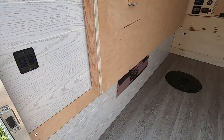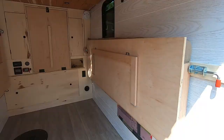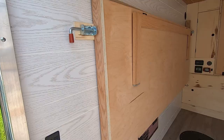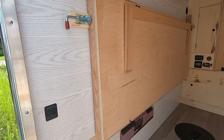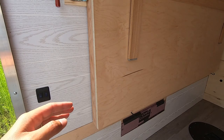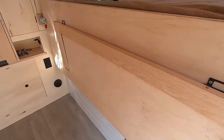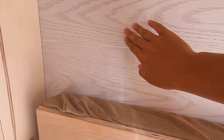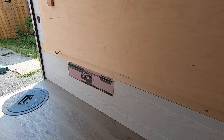The other thing I would probably do differently is choose a different wall finish. This is just a thin pre-finished panel board that I used on the walls — I chose this material because it was cost effective. These 4x8 sheets were about $38 each, and with the price of wood I had to be wary of material costs. The thing I don't like is that because it's very thin and flimsy, you can push on the wall and there's some give. I installed my strapping at every 2 feet on center, but I could have put it at every 16 inches on center to avoid this issue. I should have just opted for slightly thicker material.